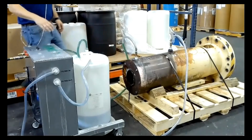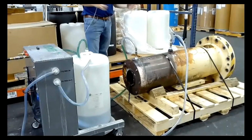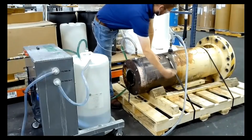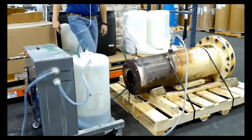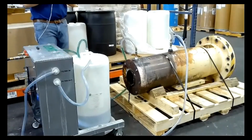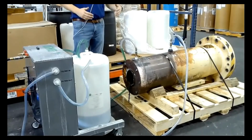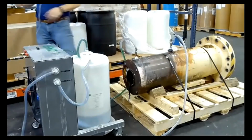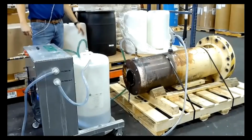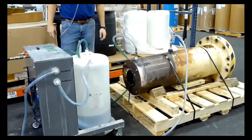So eventually, I do want pressure on it and the chemical that's in there to eat away at whatever's blocking. Now, these cooling channels happen to go halfway down, kind of in a semicircle before turning and coming back. This is flipped upside down for any extruders out there. But I do want that pressure up against the buildup. That way it starts to eat through. Then once I achieve flow, the pump will kick back on, and we want that flow. We want the chemical to eat everything that's around it. So this one will take a little bit of time, but I at least wanted to show you the pump in a pressure block situation.